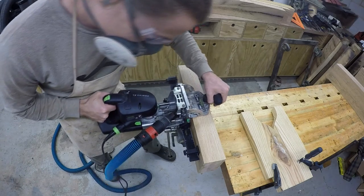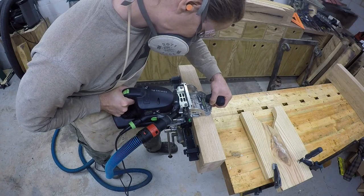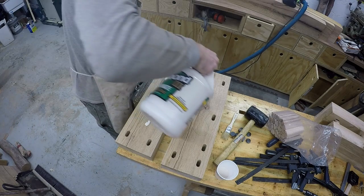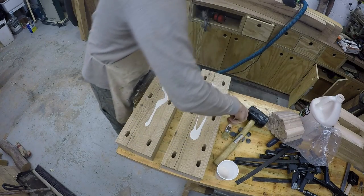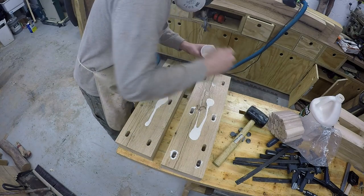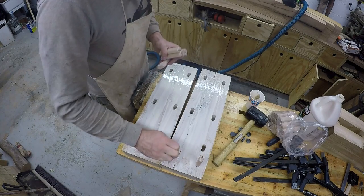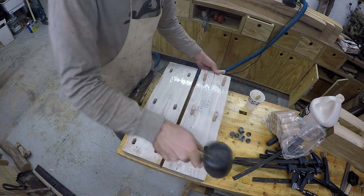These pieces were joined using Festool Dominoes — this is the Festool Domino XL 700, the larger of the two. I'll put links for all the tools I mention down in the description. I used this method several times in this project to join different pieces of wood for the base, and it works really well. The biggest reason is alignment — it's also a mechanical piece between the two pieces of wood, adding strength. In the end, all I had to do was take a card scraper to that joint a few passes and it was totally flush. It's a very accurate cut and the dominoes are a tight fit in the mortises.